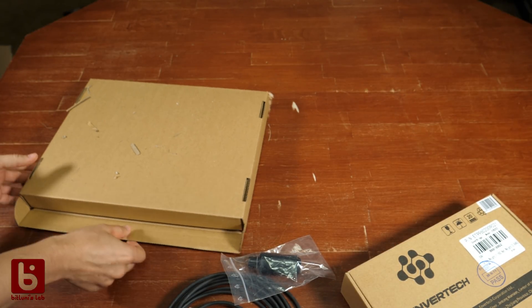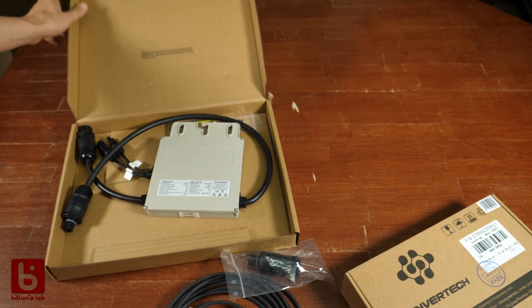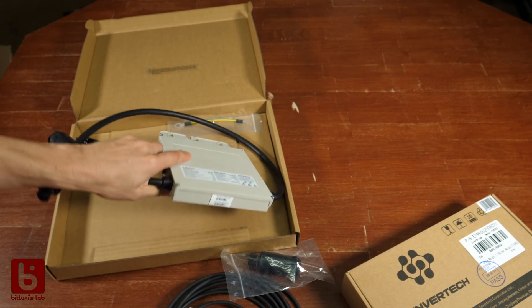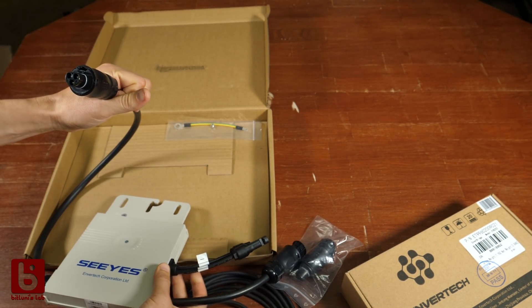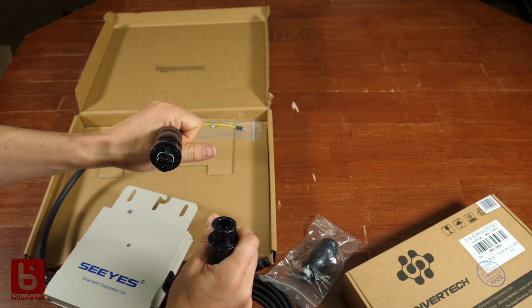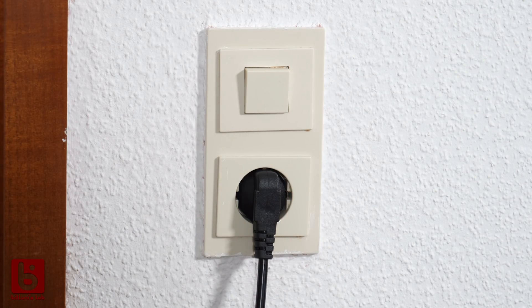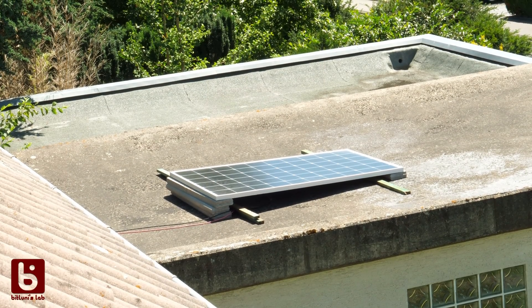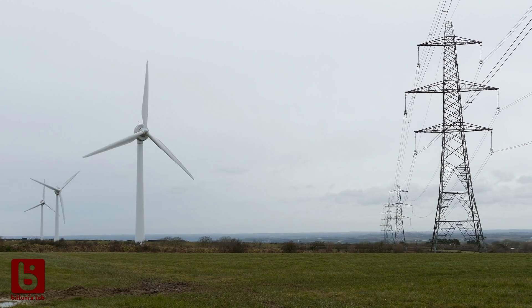Good news is the solar tech has advanced rapidly in the past years addressing these issues and these affordable microinverters showed up. I got this one for about 150 bucks. These are designed to feed the solar power directly from the panel into your AC power line. They match the phase and frequency of the power line automatically. This means you can still use your outlets and as much power as is available comes from your rooftop, balcony or garden. If you need more power than the solar cells can provide, the rest is taken from the grid.